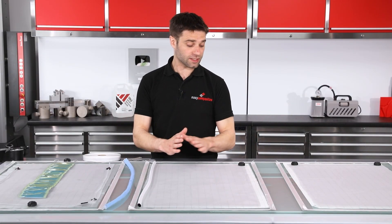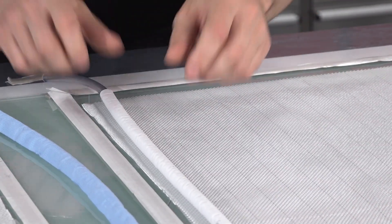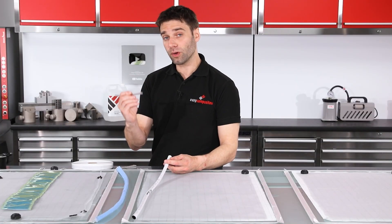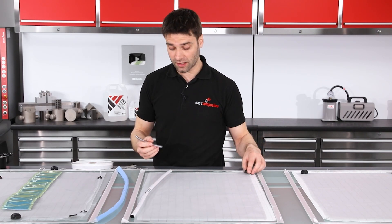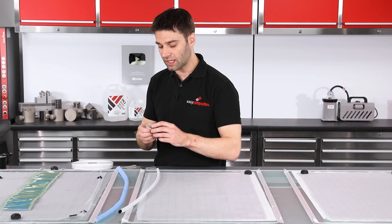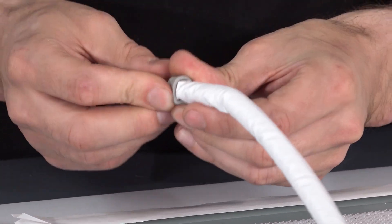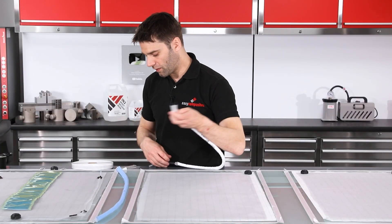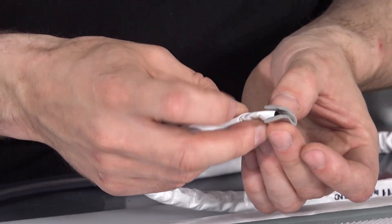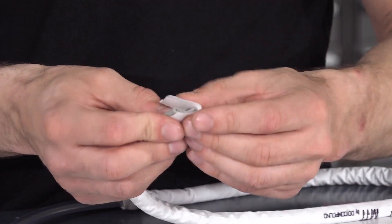Now we're going to connect up the MTI. We're going to feed the resin in exactly the same location, and our vacuum connection is going to be in basically the same location in the far corner, but then we're going to run the MTI line all the way down the side of the bag. You can't use a conventional resin infusion connector for this — you need to breach the bag using the vacuum line. First, just place the hose inside the MTI line, then seal that down using some gum tape. This is very simple with the MTI hose to do — just wrap that round, making sure we've got good contact all the way around. Then we need to do the same thing at the far end, taking some sealant tape, flattening out the hose, placing it over the top, and folding the sealant tape carefully around to ensure a good contact and seal. After that, to stop this from sticking to everything else, you can put the backing tape back on.